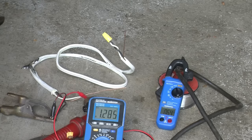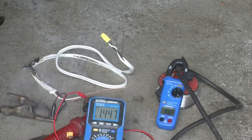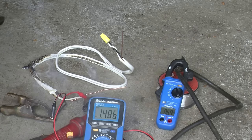Maybe we'll crank it up a little bit more — can we get to 70? Yes, that's actually as far as my setup in its current configuration will do, even though the welder in an uncontrolled setup will apparently do 240 amps. It's certainly smoking. So that's what you would get if you hooked household wiring to a load that is way too big with a breaker that is way too big. Maybe we should turn off the controlled load and hook it directly into the welder to see what happens.